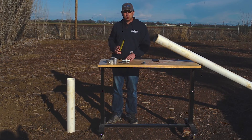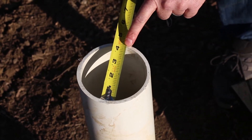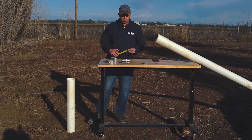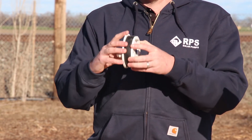In order to figure out what size of well cap or well seal you need, you need to measure either the inside diameter or the outside diameter of the well casing. If we're measuring for a well seal, we want the inside diameter — place the end of the tape measure on the inside and measure to the inside of the opposite side. In this case we have a four-inch casing, so that's a four-inch measurement. This is called a four-inch well seal. The inside is four inches, the outside is around four and a half inches, so it covers the whole top of the casing.